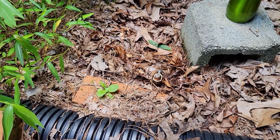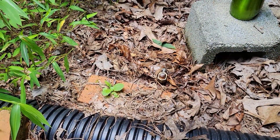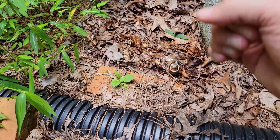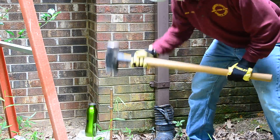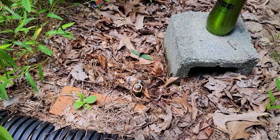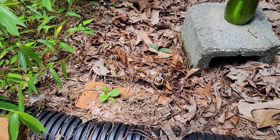This just goes to show that sometimes it's not just one solution — it depends on the type of soil and what's in it. We're in the south, so it's clay with lots of rock. We fortunately didn't hit rock, but it got much harder as we went deeper. Without the sledgehammer this would have been a much longer process, though eventually the hammer drill would have done it — it was just slow. Hopefully that helps if you're trying to install a ground rod. You can try pushing it in by hand and lubricating with water; if not, try a hammer drill or a sledgehammer — a regular hammer won't have enough weight; you need the oomph of a sledgehammer, probably eight to ten pounds. If you found this useful, give us a thumbs up, leave a comment, join the subscription team, and thank you for watching.